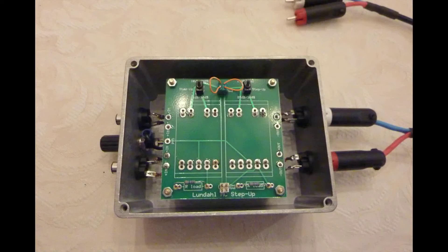Conclusions: The SUT is a low noise passive amplifier that provides gain to the signal of a moving coil cartridge so that one can use a moving magnet phono preamp. With a highly resolving record playback system, this device may reveal more detail from the record grooves and provide a more engaging listening experience. Thanks for watching this video. I hope you were able to find some useful information to help improve the performance of your audio system and enhance your music listening experience.